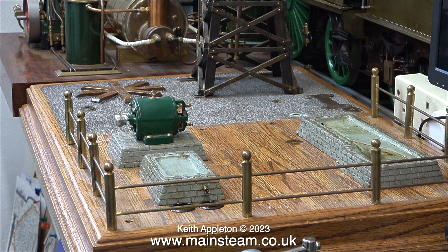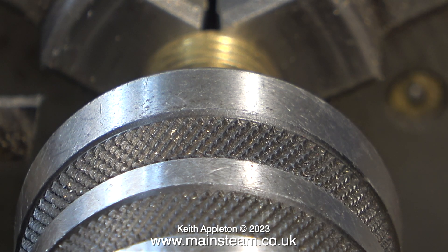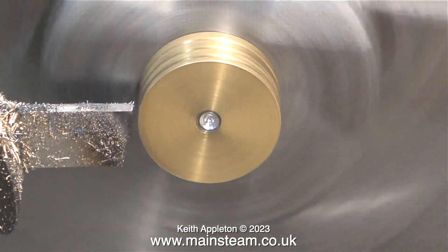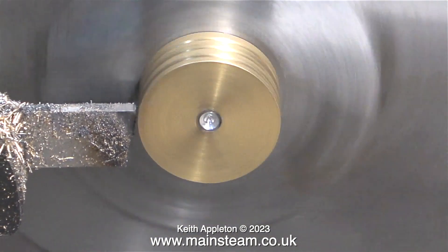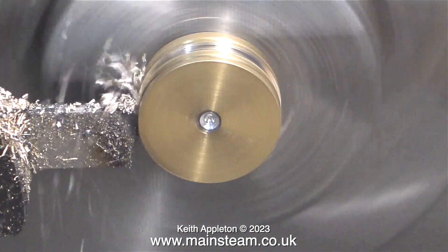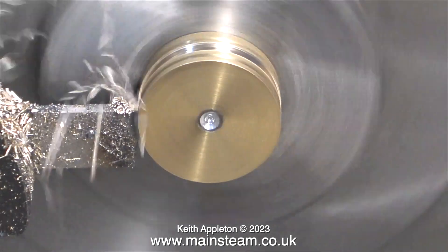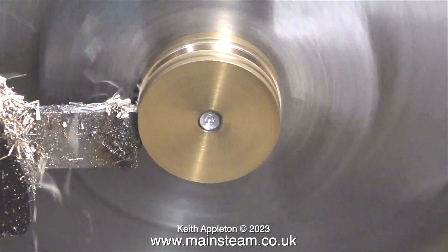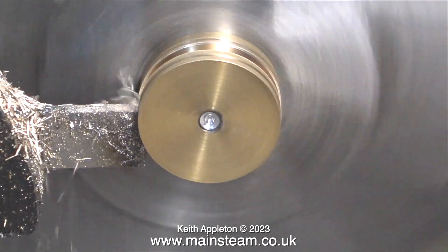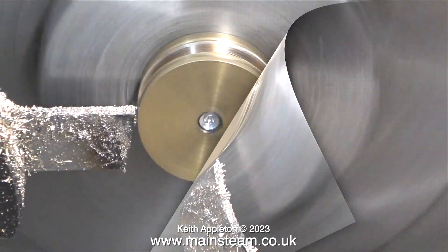I'll diversify for a moment and go up to the other workshop where my lathes are to do a bit of machining. In exactly the same way as I did with the S50s, I need to machine a groove in this double 10V piston, which is a bit larger. Because it's a bit larger but still supported on quite a thin piston rod, I centre drill the end and support it with a live center. For the purposes of the video I backed off the live center, and here using quite a sharp parting tool I'm machining a groove to take the o-ring, taking very light cuts because this three-quarter inch diameter piston is only held by a very thin piston rod. Because the piston itself is pressed very firmly against the jaws of the chuck I did this using the live center — it's actually quite well supported, but I'm still being careful.